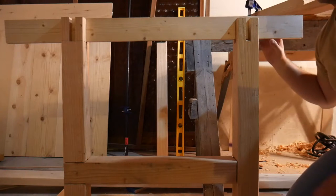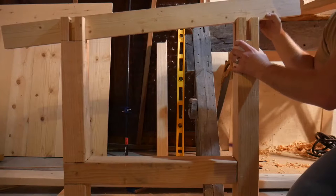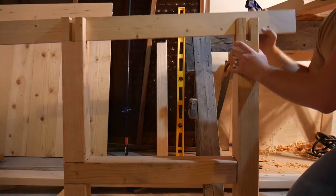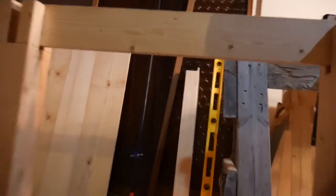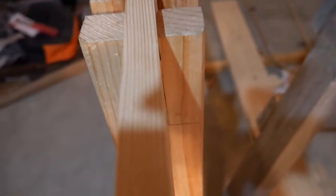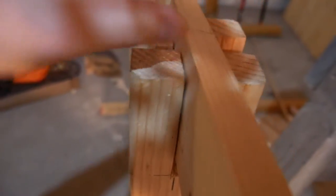I want my boards running straight, obviously. I set this piece in here to help keep it a little bit square, but because it's just an eighth off, it makes it not slide in quite so easily. My joinery is a little bit sloppy, as you can tell, but it's not too bad for my first time ever doing it. As I get more experience it'll flow better. Next time I'm going to make this gap a little bit thinner and put some shoulders on each side so it'll cover up any imperfections.